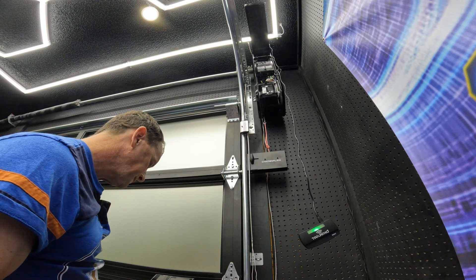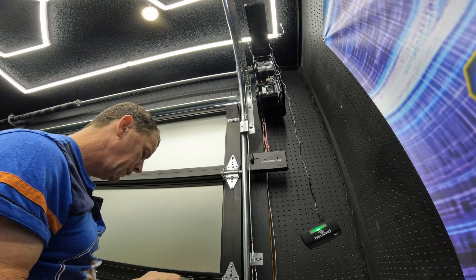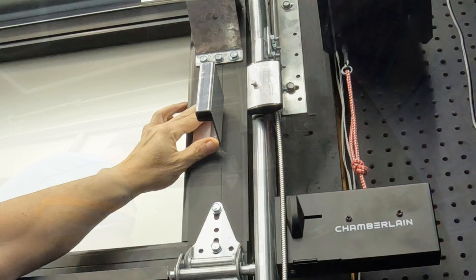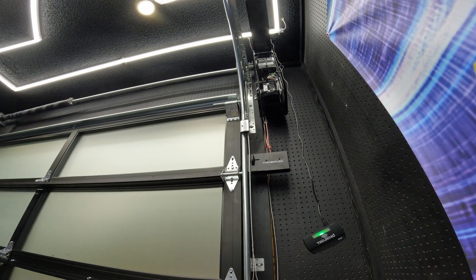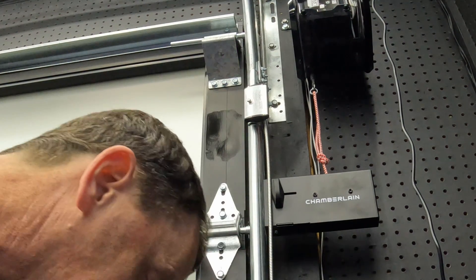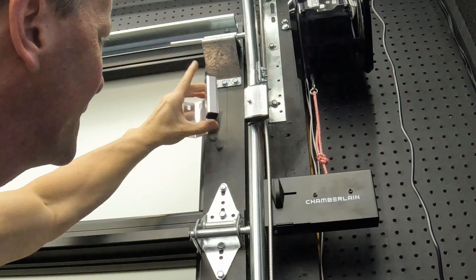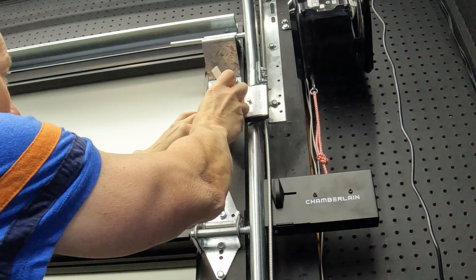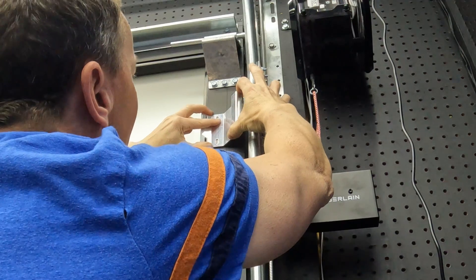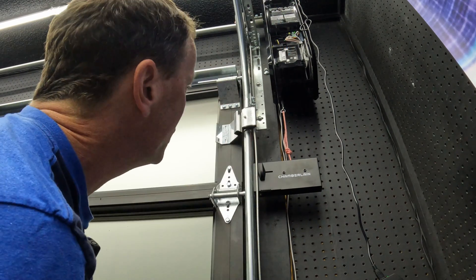Make sure it's dry before you stick it. There are two sets of mounting holes on the magnet so you have options on how to position it on the door. The next step is mounting the magnet to the door — we need to use the double-sided tape and we had to go with the angle mount because it would be too far out using the flat mount. I cleaned the area on the door with Windex, then mounted it less than two inches from the door on the angle bracket, applied good pressure. That looks good.